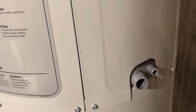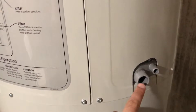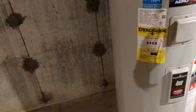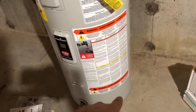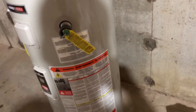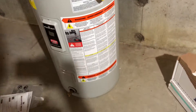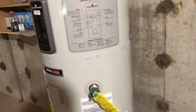These things also have a condensate valve. This unit produces condensation as it dehumidifies the air because it's drawing air in from the room. We're going to have to install a drain line that will go, in my case, over to the ground and hook into my home's drainage system. If you didn't have that, you could also install it into a floor drain. If you have absolutely nothing, you would have to have a drain pan here underneath with a tube coming out into a condensate pump. They fill up and kick on just like a sump pump and pump it out to wherever you want - a drain, out a window, whatever.